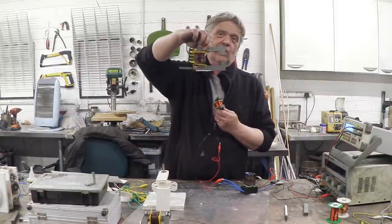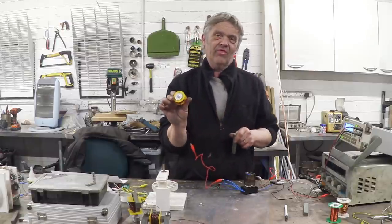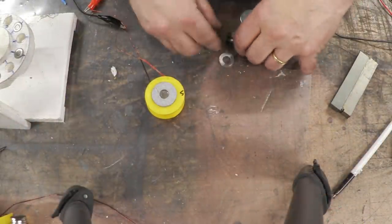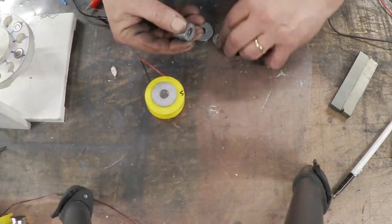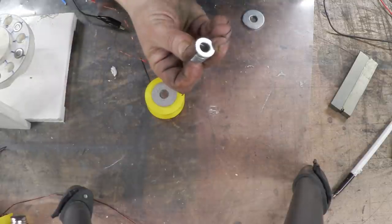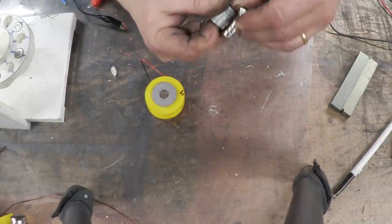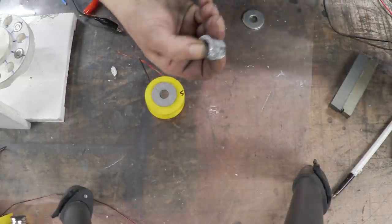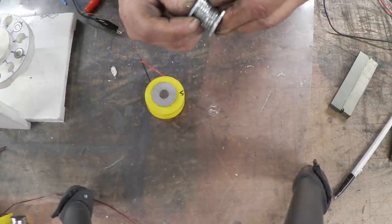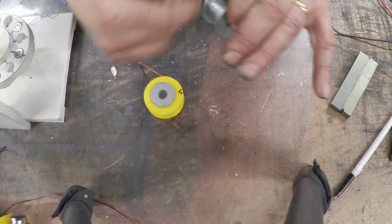That basic magnetic switch looked complicated with all the sawing and shaping, but it's really easy — it's just two metal bars. Let's have a close-up. This is surprisingly uncomplicated: it's a stack of 10mm washers, super-glued into a stack to make a tube that's 10mm in diameter. I used 10mm diameter neodymium magnets — five of them at 2.5cm — which fit nicely in the centre of that washer stack. Then I added repair washers on the top and bottom to make a metal bobbin.